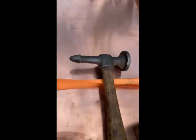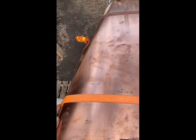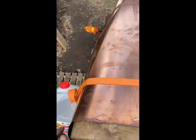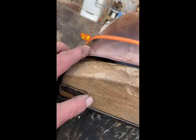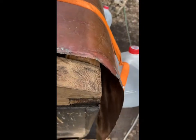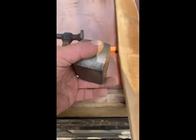We got our front pulled pretty tight. The thing is, these sides have to both curve — it goes this way and that way, the roof. At this edge I'm going to try to get this all in one piece. I was thinking of cutting this off at the brace and then hammering that out as a separate piece with rivets, but I'm going to try to get this as one piece. You can see this has a ways to be worked. That side is a serious problem — that crease actually makes the metal stronger than the surrounding area around it. My buddy Kelso brought by some body irons and I'm going to try to straighten that out.